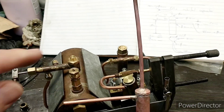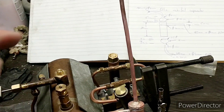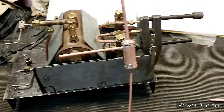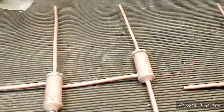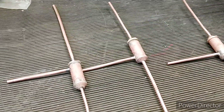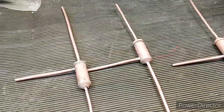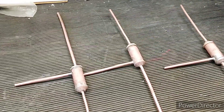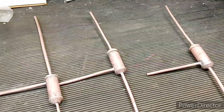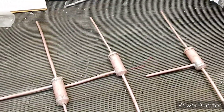This longer pipe will be bent over to the chimney and then another 90 degrees so it's pointing upwards - that will be the clean exhaust steam going up the chimney. If there's any excess I'll just chop that off later. I hope you found that interesting and useful. It is a very good upgrade for a smaller loco - it really helps filter out all the water from the steam. Like, share, subscribe, and I'll see you in the next one.